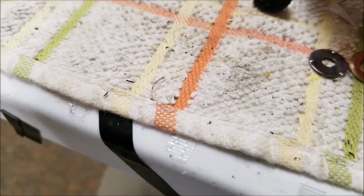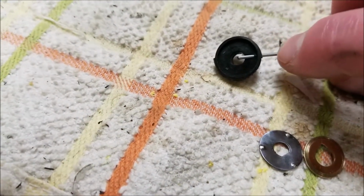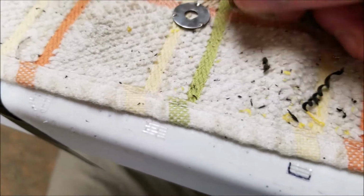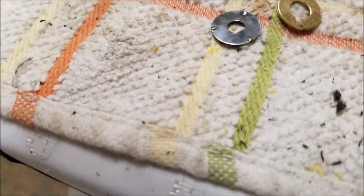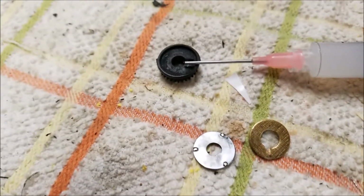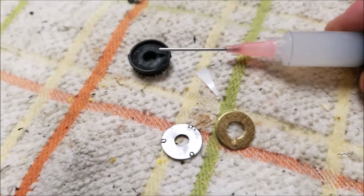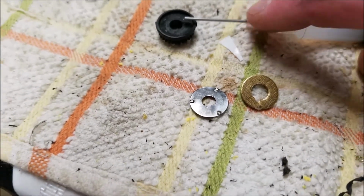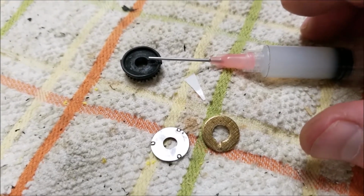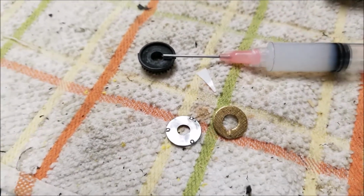And the location of that hole, I always put it under one of these little lobes that hits your BB agitator so you can find it, because it is tiny. And on the underneath here, it is kind of scalloped out so the needle can pass it and go all the way and actually hit the shaft that it goes on. That way, when I go to adjust it with my trigger gauge, using the needle as my trigger basically to find out where the clutch breaks, I'll always have that same distance in there when it touches on that shaft.